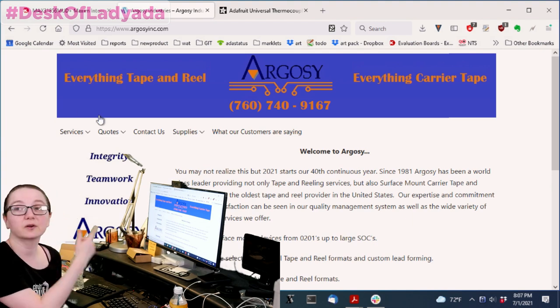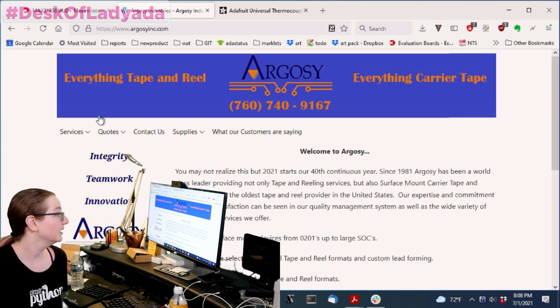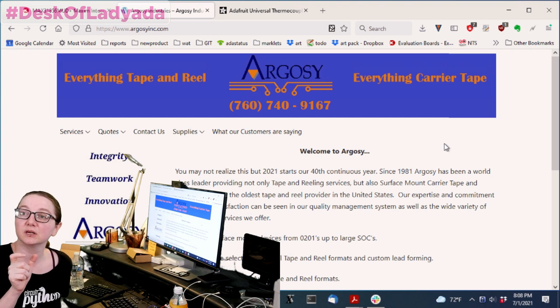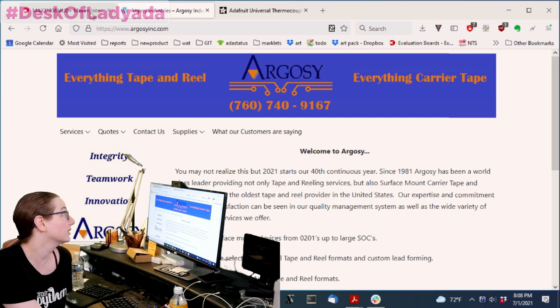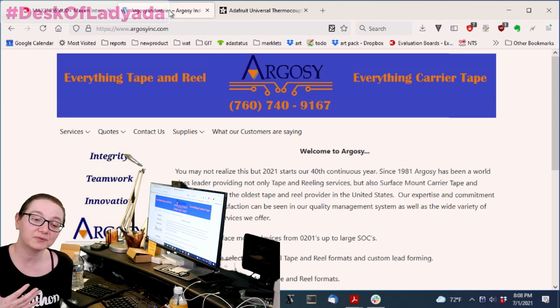One thing you can do is get tubed parts taped. You buy the tubes, then send them to a taping agency. The agency puts them into a custom tape and reel for you. There's a setup fee and a couple cents per part to get it taped — weird shaped parts cost more. I recommend Argosy — they're in California, lead time about a week, and you can even drop ship your tubes to them directly, then put in the purchase order and they'll take care of it. I've always had excellent luck with them — parts are placed identically, nothing gets rotated. Some parts we use don't even come on tape and reel, so we use Argosy all the time. DigiKey to get the parts, Argosy to get them taped.